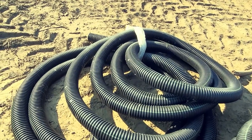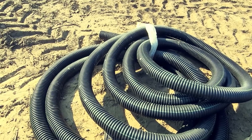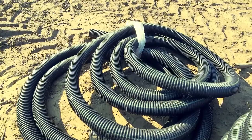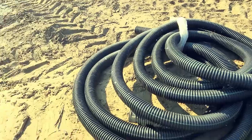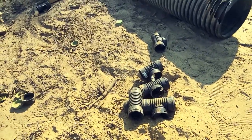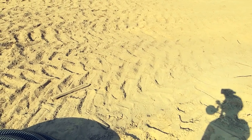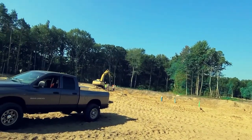Here's the actual edge drain — this is four inch. Generally on bigger road jobs you work with six inch, which is a little bigger. But essentially it's just drain tile, just like you'd have in a farmer's field. This is perforated, corrugated plastic pipe. Here are all the fittings you use to tie it all together. There's only a certain distance you can go before you have to tie into a manhole — that's generally designated by your prints or plans.